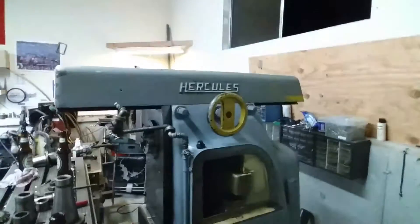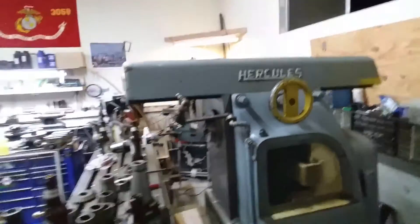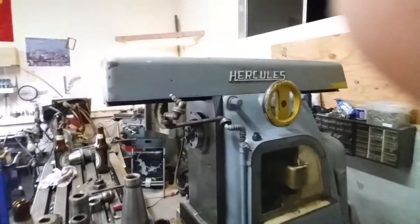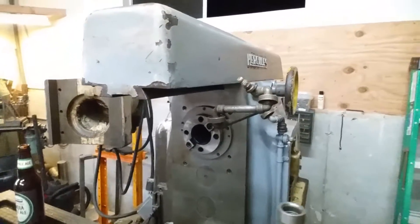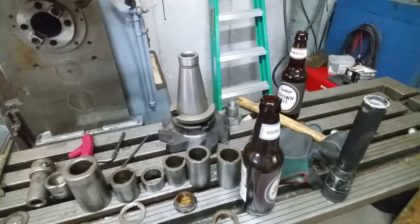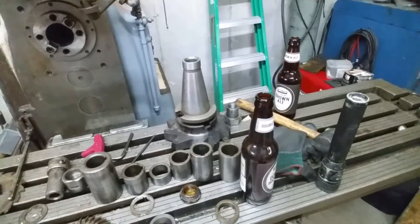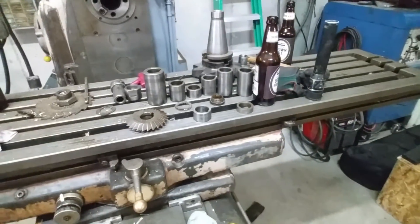Let's see if I can turn this thing — I have to do it like this. I can't change my viewfinder to go the other way, so hopefully you can see what I'm trying to get at. So there it is — Hercules 1963, universal horizontal. It's a 50-taper machine, so I can run a big-ish boy like this shell mill here. It came with 10 good inserts and it should be able to do some cutting.